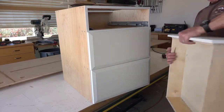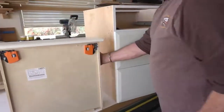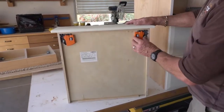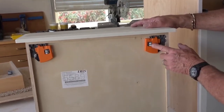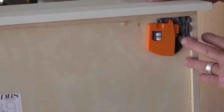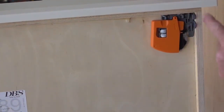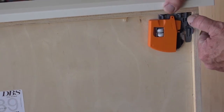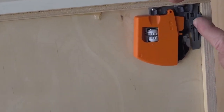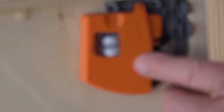Let's look at the bottom of the drawer. You'll see the locking devices that are attached to the front of the drawer box. These particular locking devices have side-to-side adjustment in them as well as up-and-down adjustment. This little ramp-style device on the side of the locking device gives you up-and-down adjustment, and these two dials here give you left-right adjustment.